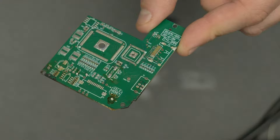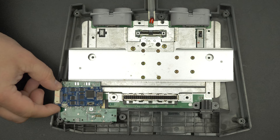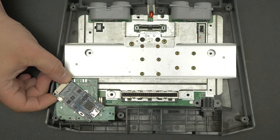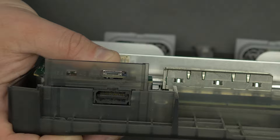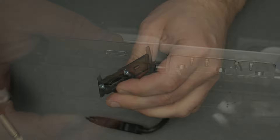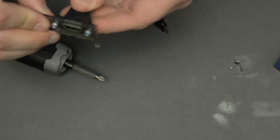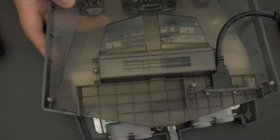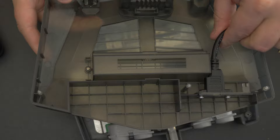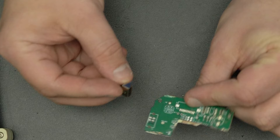Now with a clean board, I wanted to use it as a mount. I tried a few different positions and it almost looked like I could have mounted it in front of the existing HDMI hole using industrial strength double-sided tape, but the cartridge slot ran right along where the board would sit, making that impossible. So I decided to use an HDMI extension and mount the board elsewhere. I carefully drilled holes by hand into the plastic HDMI bracket in order to mount an HDMI extension cable directly into it. After a test fit, the cartridge slot was in the way of the rubber shielding, so I trimmed some off — but trimmed a bit too much and cut one of the wires inside. Luckily I bought a second one, re-cut it only where absolutely needed, and the top cover fit just fine.